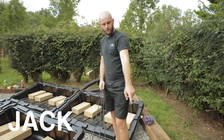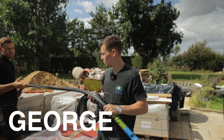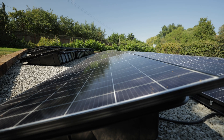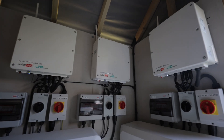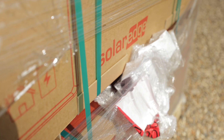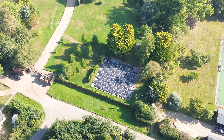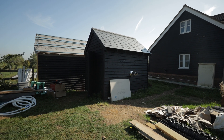On this job we've got the full Self-Heal install team — Rob, Alex and George — with the task to install 80 Canadian Solar 430 Watt HiHero panels, 80 SolarEdge optimisers, 3 10kW Home Wave inverters and 9 10kW SolarEdge home batteries. As per the plans, the solar array is located at the top of the garden, with the inverters and batteries being located approximately 80 metres away.